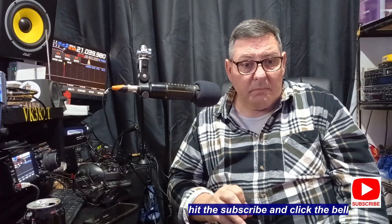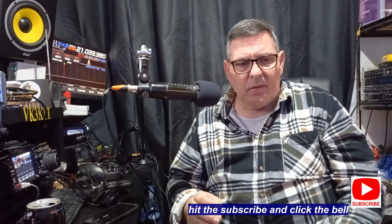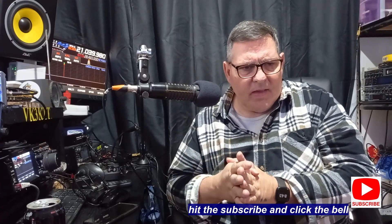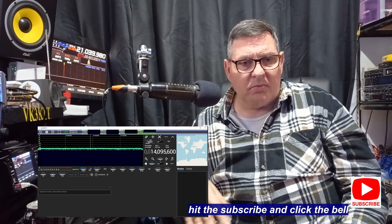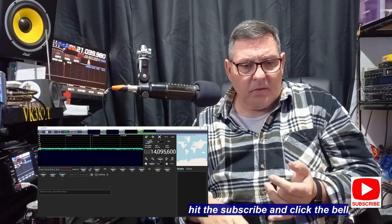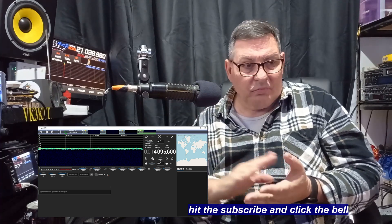Receiver-wise, it's pretty good and you can capture a lot of things with it. Another piece of software to check out is Spark SDR. If you're like me and you like doing FT8 but also want to monitor other bands, you can monitor three things at once - FT8, FT4, and WSPR all at the same time on one of these Hermes units. And with a wide enough band setting - up to 10 megahertz - you'll probably get two or three bands in there, which is great.